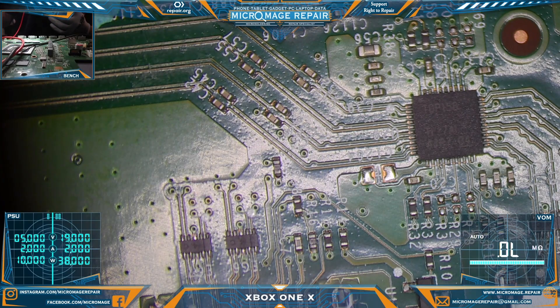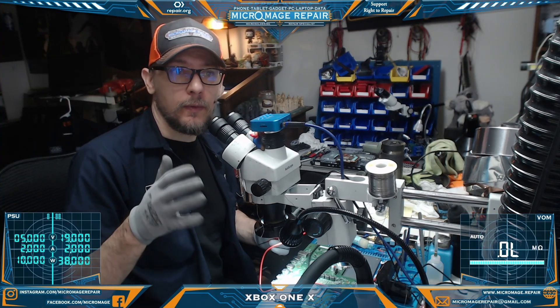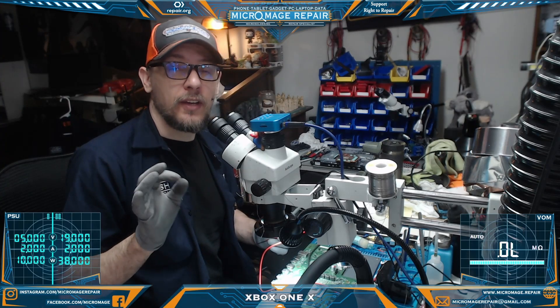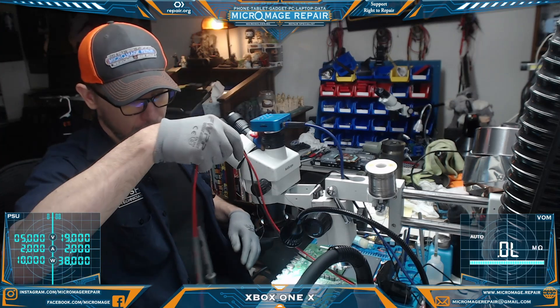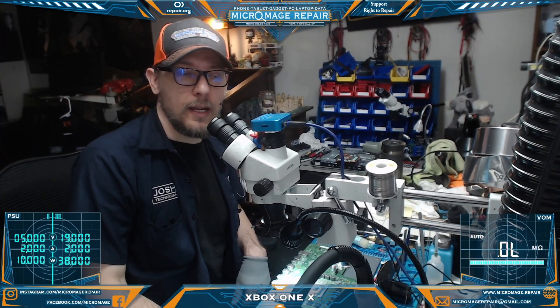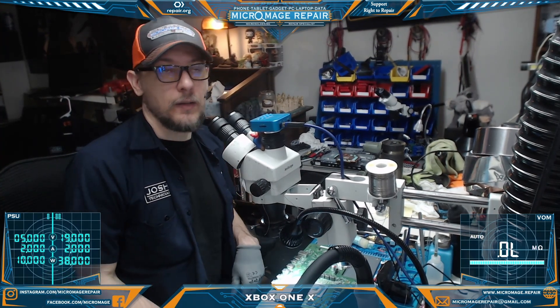So that's a low ohms rating as well — pretty much 100% that the retimer is dead when you get that rating. Now it can still die and not give you that low ohms rating, as we found out in the last video. It can be reading fine and still be dead. But if you're getting this low ohms rating, I'm going to say it's likely 100% the retimer is dead. This is still a new procedure for me, but I want to say it's about 100% if you're getting that low rating. So we're going to go in and change the retimer.